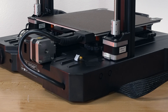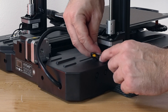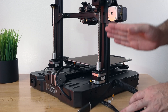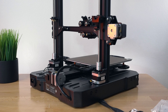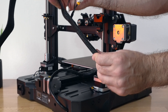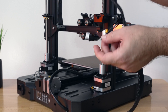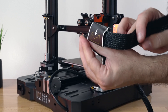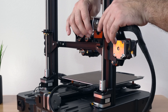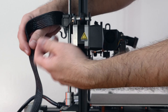On this side of the printer there's a z-axis plug taped to the base that simply plugs into the motor. We have our main wire coming out the bottom that goes up to the hot end. The bracket we talked about earlier holds the flat part of it. About midway there are a couple more wires — one for the x motor and one for the x end stop switch, both located over here. There's also a sticker on the wire showing it slots into this bracket, so let's go ahead and insert it.